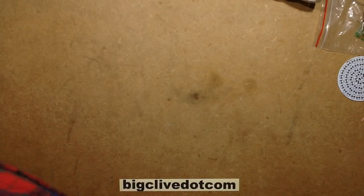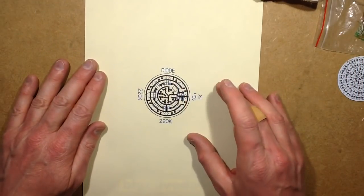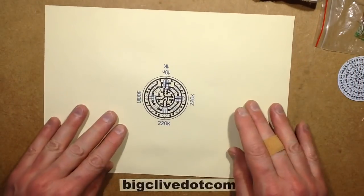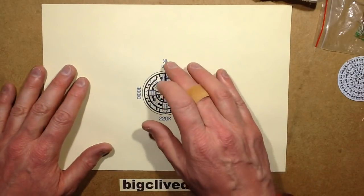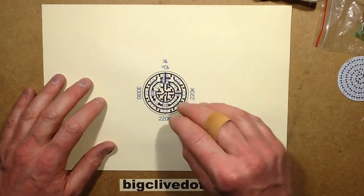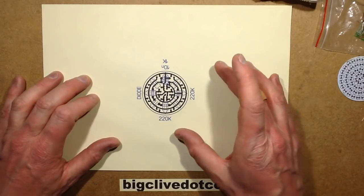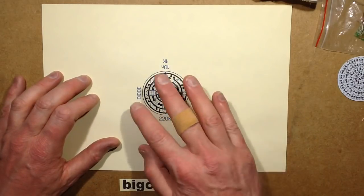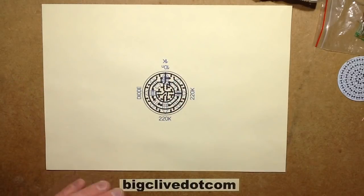And I printed that off. Well, actually, it doesn't really matter which way up it is because all the text is in random directions here. These are just little notes. Because this is a prototype circuit board, it's not got a screen print as such, and there's not much room on it for adding screen print. I've just put component values as memory joggers because I'm only really interested in the tracks. And I've printed that out onto a suitable film.